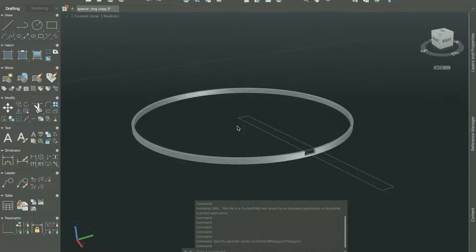Here we are in AutoCAD, which I've shown before in my making custom dials series when talking about 3D printing dial blanks. I just wanted to show what the spacer ring looks like in the 3D environment. The steps are basically: draw a circle to the appropriate interior diameter, draw a second circle for the exterior diameter, create a solid at whatever height, bore a hole through the middle, then create a rectangle — two millimeters wide, one millimeter each way from center — to the appropriate depth, 0.75mm in this case since the height is one millimeter, and cut the hole out.